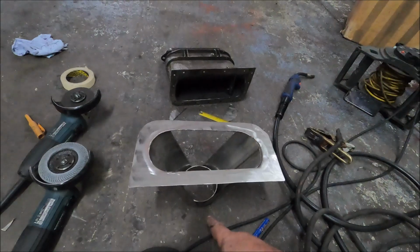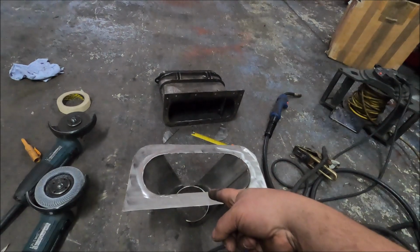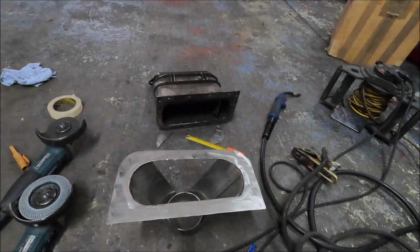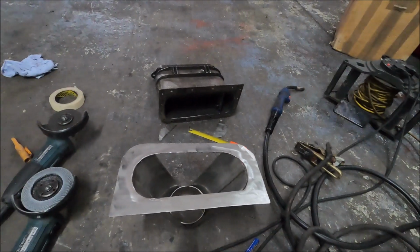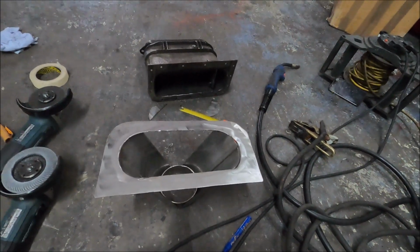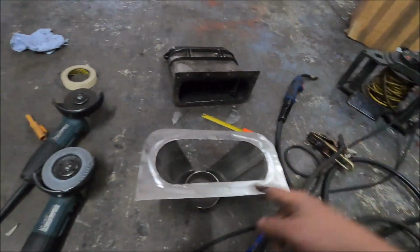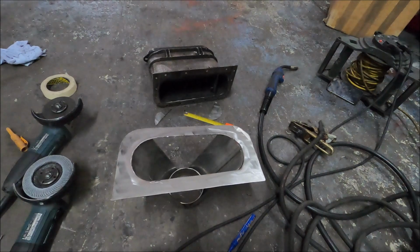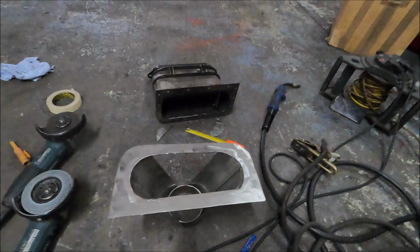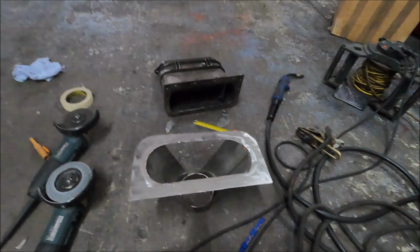I think I'll put a V-band at that end, and this is just a way of basically getting this Inconel section joined to the stainless section, because I'm not sure, but I would guess Inconel is maybe a bit of a bugger to weld, and I never know if I want to change it. So this is, you know, removable. I'm never going to do it. I will probably add some high temp sealant around this as well, and bolt it all together, and then it can stay there until any time when it needs removing. And that end will have the V-band, but yeah, we'll see.